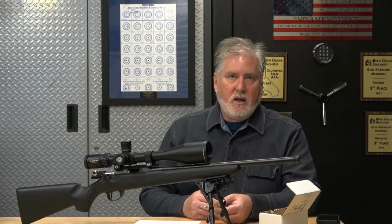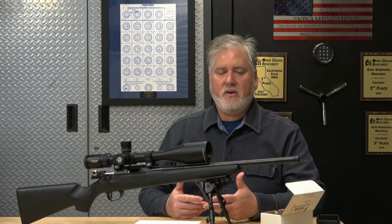Now I will say, Timney, at the time, I got a hold of them right away. They sent me two sear springs. I was one of the first, an early adopter on these triggers. I bought them as soon as I saw they came out. So I think Timney realized what was wrong, and basically they sent me some heavier springs. Once I installed those springs, I had challenges for maybe the first 100 rounds, but then it's been great ever since, and we're probably talking another 1,500 rounds since then. I didn't mean to go around that way, but in a lot of ways it's why we're here today talking about it.